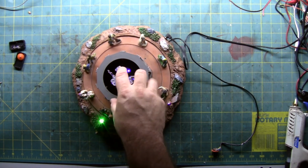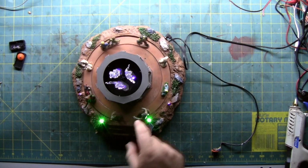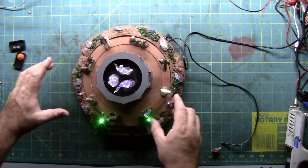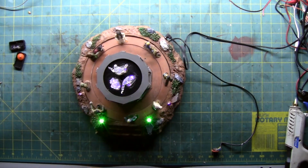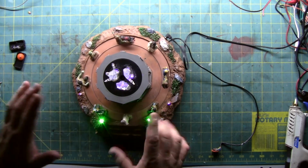Pop it off carefully. Pull it straight up off of the 3 guide bars. Pull the center section out, which is the 3 guide bars and the gear. You can also lift these characters off and set them aside. There's 3 more screws, which allow you to access the mechanism in the bottom and the circuit board.